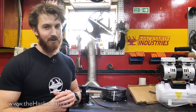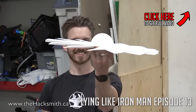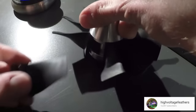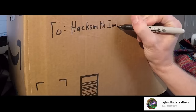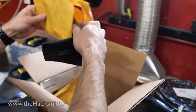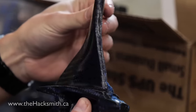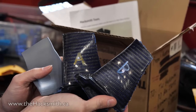To try and reduce that cost, we did try designing our own EDF, but the amount of engineering time that would have to go into the design would actually end up costing much more than just buying them. So we're not going to pursue designing our own EDF. That said, one of our subscribers is actually looking at designing their own 300mm EDF — he's 3D scanned and upscaled the blade design from an existing EDF, modified it in CAD, 3D printed it, and then coated it in carbon fiber. He actually sent us a sample of one of the blades he built. Carbon fiber is one of the few things we can't do here at Hacksmith Industries yet, but it's really awesome to see what is possible.